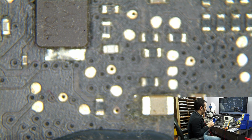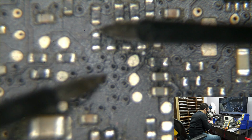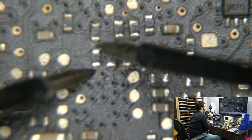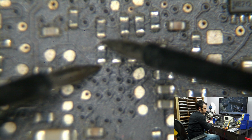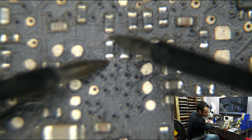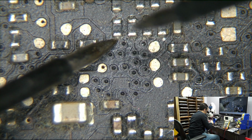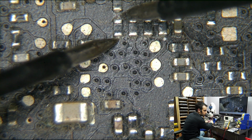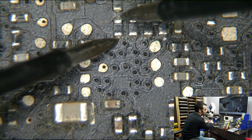Go back to resistance mode on the multimeter. That's blurry, but whatever. So, 280 kilo. Actually, let's see. 1 kilo ohm, 2.3 kilo ohm. Losing patience. I hate holding that thing there and waiting for it to calculate resistance. Let me at least make that look better in the meantime. 500 kilo ohms, 600 kilo ohms, 500 kilo ohms. See why I use diode mode for most things? I don't have the patience for resistance mode measurements. 473 kilo ohms is what we settle on. Schematic says you're supposed to be 470 kilo ohms, so you're not the problem.